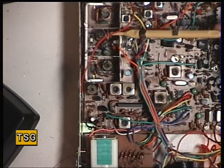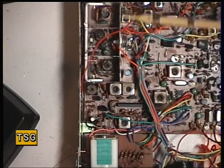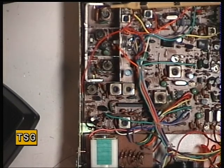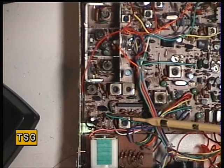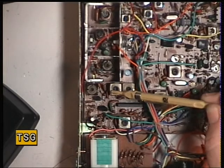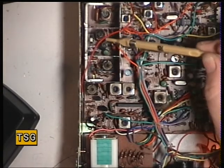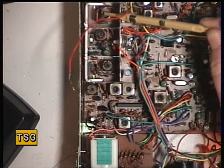The next one is T305 in that compartment, which is the output transistor there. And finally it's T307. And that is it with the coil line-up. So it starts with T207, T208, T209, T301, T303, T305, and T307.